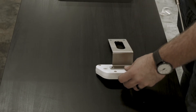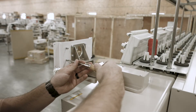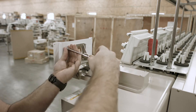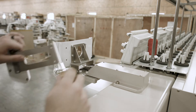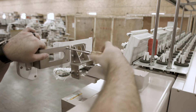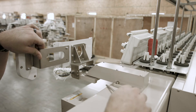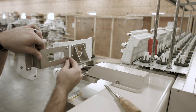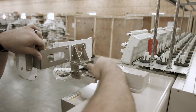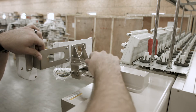From there, we're ready to put the panel and the keypad on the machine. The first step in securing the panel and the keypad to the machine is to loosen the two screws on the left and take them completely out. From there, we'll grab our keypad and place it on the machine, then go ahead and firmly tighten each screw.